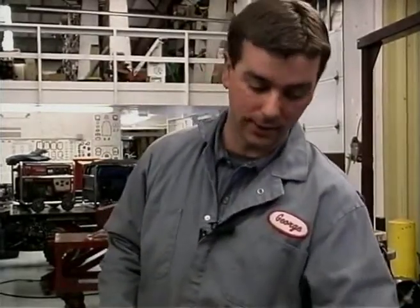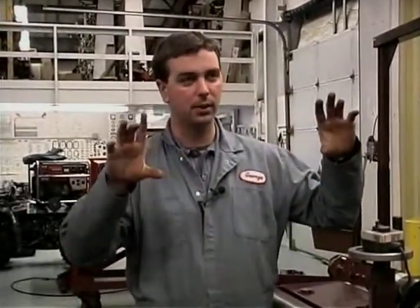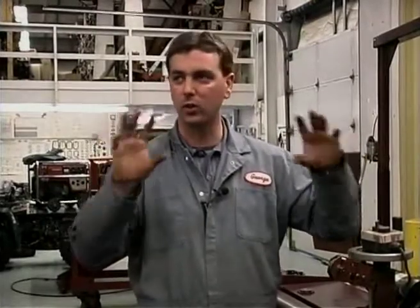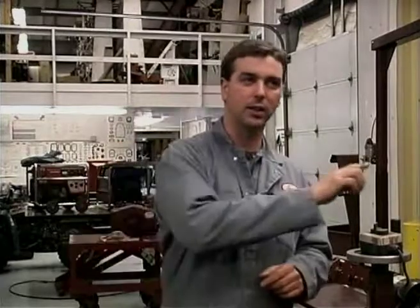So this is kind of a new invention. Last year was the first time I'd ever seen it. It's very handy, a very good idea. And I can actually measure the diameter of my reel and from there make a decision. On that Peerless Simplex, that's what they're doing: they're bringing it up, they're measuring it with this tape, and they're seeing do we have a cone shape or not. If we don't, then we're just going to bring it up till the stone touches all the way across.